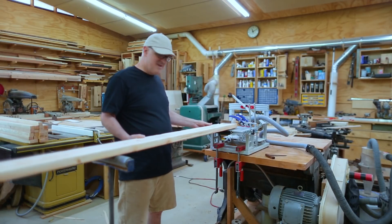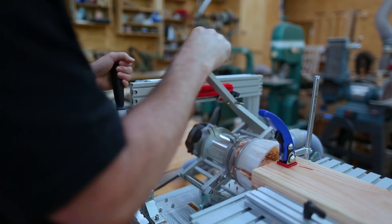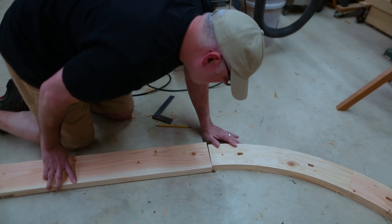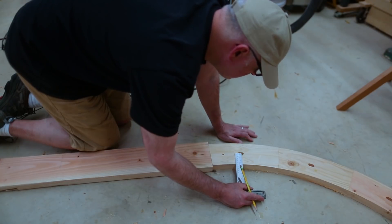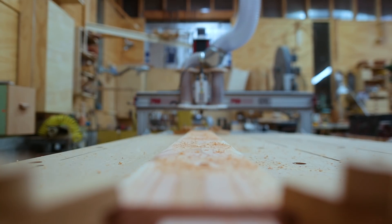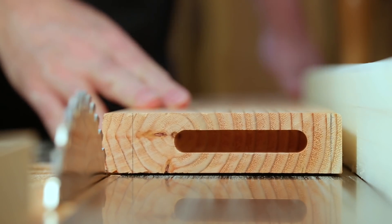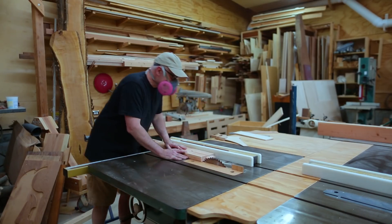Now I needed to work on the legs. Two of them need a mortise and two need a tenon because of the way the mortise and tenons work in the arch. Because I made the arch a little thinner than the original two-by-six, I had to cut the legs down just a little bit — easier to do on the table saw than the CNC. I figured out where the mortises would go in the legs and cut those; once I did one, the other three went really quickly. I marked for the leg width so the sides would be flush with the arch — it just has to be pretty close, it's just lumber.